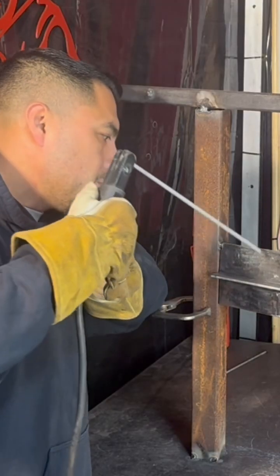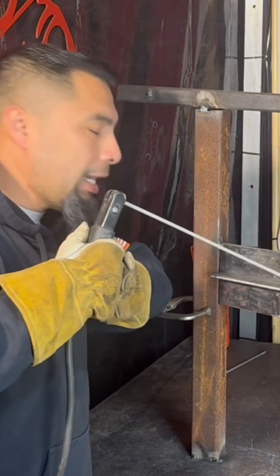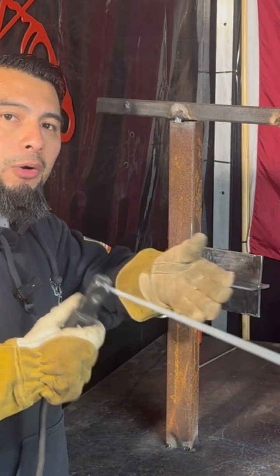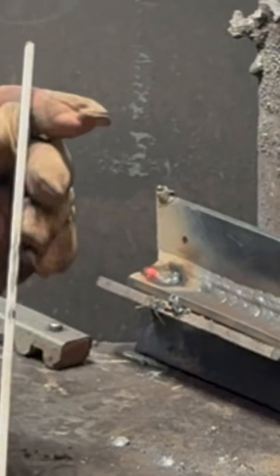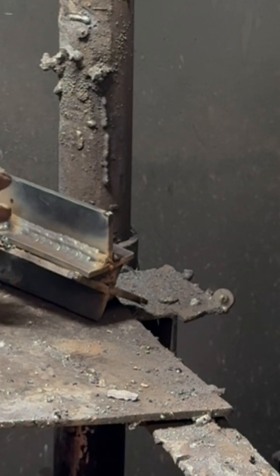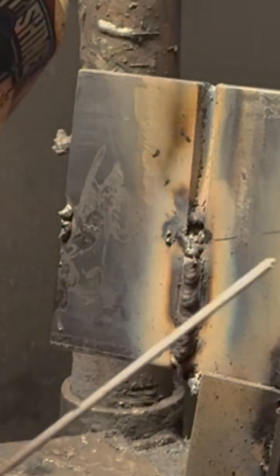Having to try to fight through that flux or having trouble starting up that arc — because I don't have metal-to-metal contact. So we're gonna get into that. One of the biggest mistakes that I see people doing is trying to tap that electrode on their work table, or scratch it on their work table, and then go back to their coupons, still having issues striking up. Once you break through that flux, whether it's tapping it or scratching it, that doesn't mean you're gonna have a good start right away.